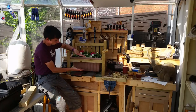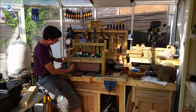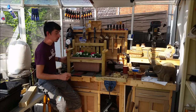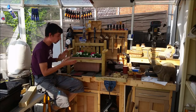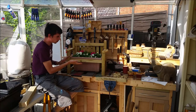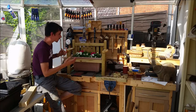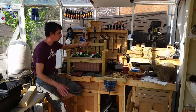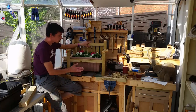You work out how high you want the trough to be against the leg, mark a line, then mark where the timber sits on that face, and go back and mark where you want the mortise - then cover it in with hatching. Whether you use a bench mortiser or a hand drill and chisel, I find that doing it that way I know exactly where my timber is going to end up, so it lines up precisely where you want it. Then just work around all the mortises, clip it all together, and that's it.